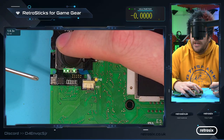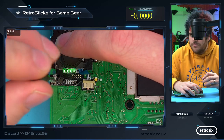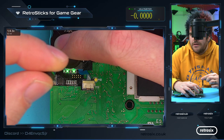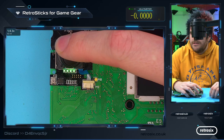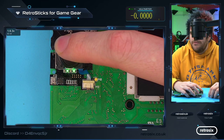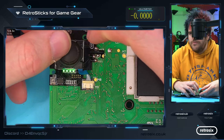Go to the bottom diagonal. The right LED's gone off, but the bottom hasn't. So the bottom needs to be a bit more sensitive. So the bottom potentiometer turns slowly, really slowly clockwise. And you can see there it's going off. So there's your diagonal on your right and your down. And I'd say that's still right on the balance of barely hitting. So I'm going to just gently turn the down one more.